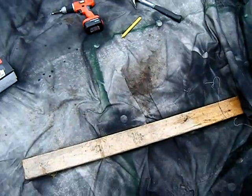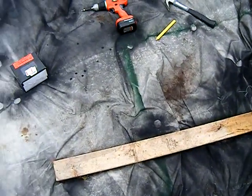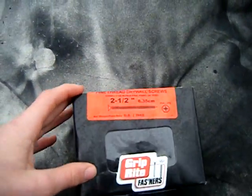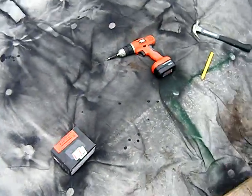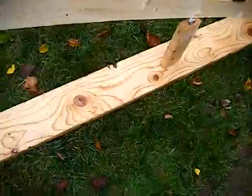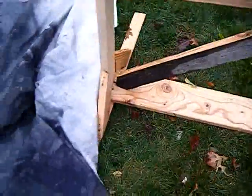You're going to need two-by-fours. I recommend getting about two sixteen-foot pieces at Home Depot and maybe one eight-foot piece for extra. You'll also need two-and-a-half-inch or three-inch screws — I usually use two-and-a-half-inch. You'll also want a piece of two-by-six, and then you can use your old rail like I showed in previous videos, or just get a new eight-foot piece of coping.